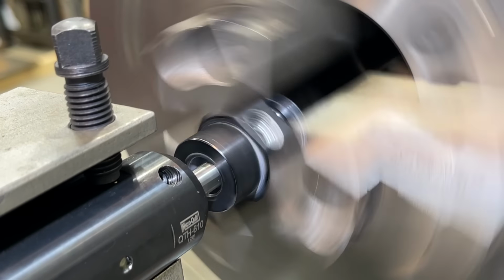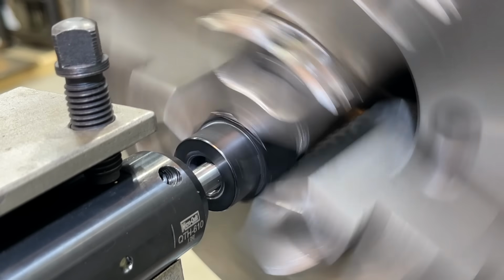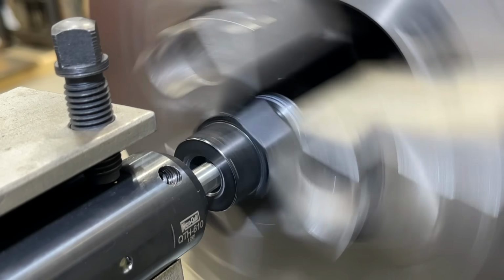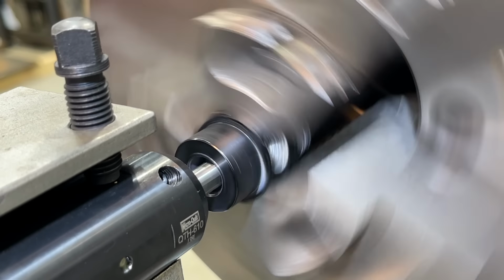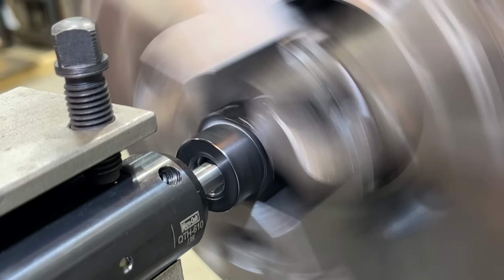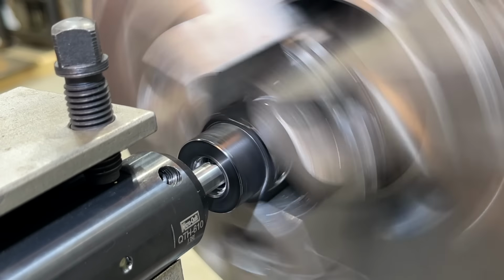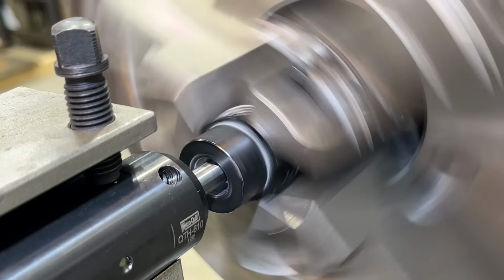See, you can't even see it, that's why I'm saying it's hard to share with this kind of stuff, but we'll get her done. So I'm using the digital readout and I'm on 1/2 inch. I want to take the tip of our tool out to 0.750 on the DRO. There's the bottom of our groove there. Take it out to 750.